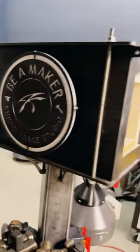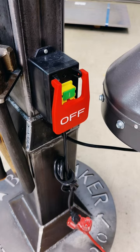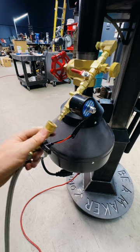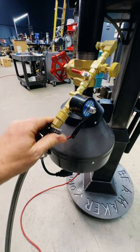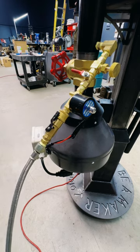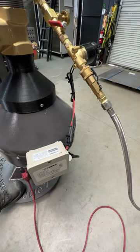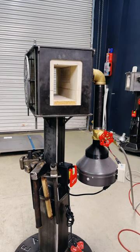Safety is the utmost importance. We have an on-off switch that's wired into the fan, and also a normally closed solenoid that's plumbed in line with the propane system, and that is also tied into the fan. So if something were to go wrong, or the power were to go out, the entire system shuts itself down and the flow of propane stops.